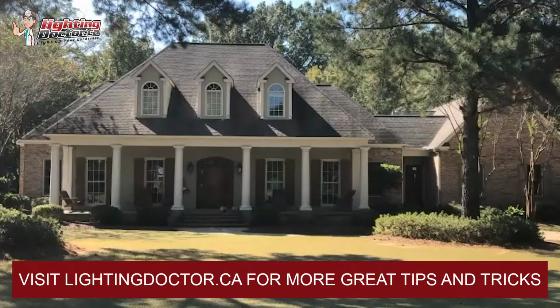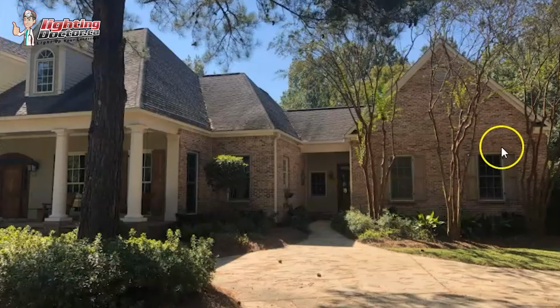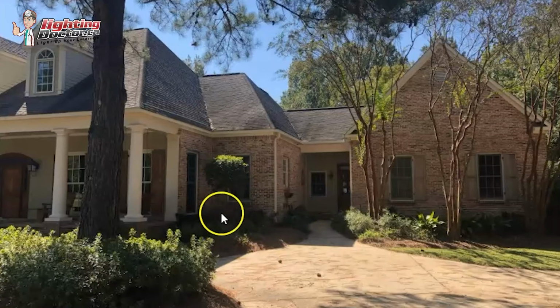And then, if you've watched a lot of the other videos, I talk a lot about lighting the brickwork and all that kind of stuff. The nice thing is you have perfectly placed landscape features that I think you could really light. And I don't know if you'd have to put nearly as much of the lighting on the house. So for example, I would probably try and get an uplight on this corner tree here that grazes this tree, as well as it's going to create some light onto the front of the house here.